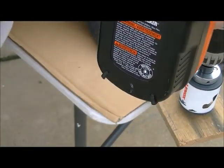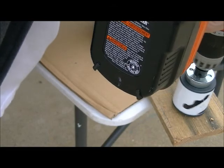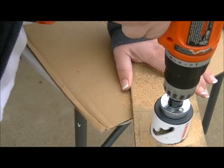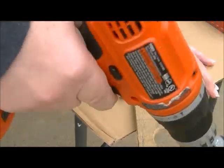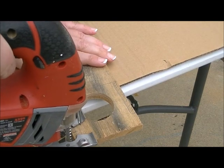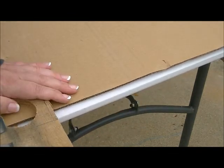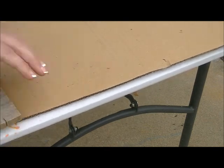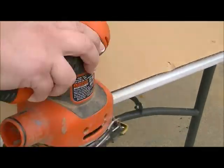Once you have your template you can go ahead and cut your hole — just try to center that up and use your hole saw to cut out your picture opening. Once that's done we can start cutting out our gift box cuts. I'm going to start with the lid at those two quarter-inch marks, and then we can flip our board around and make that one cut all the way across the bottom of the box at the three-inch mark to remove the bottom of the pallet.